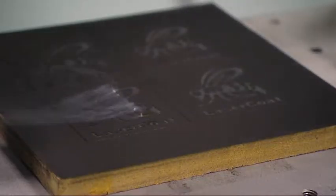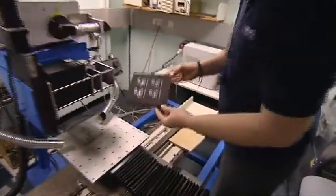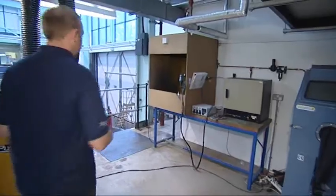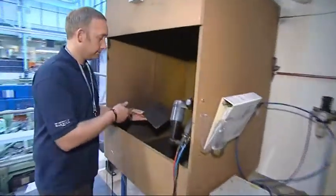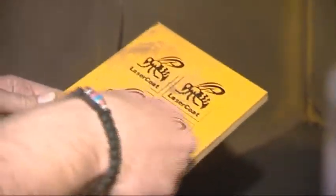The powder coat process is more involved than the laser etching — it takes a number of processes of spraying and curing. First of all, we start off with a background, which is post-cured in an oven box. Then we re-coat the background with a contrasting colour. This is then laser consolidated, and then we post-cure this again in the oven box, producing a nice contrasting mark.